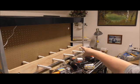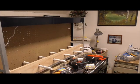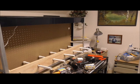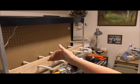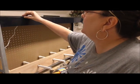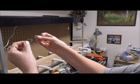And then when you get down to the other end, it's going to have to be on the inside of where the cup is, according to the way we're trying to lay it out. So it's up to you. You figure out how high you want your switches, how low you want your switches, where you want your switches, and then you're going to have to just make a hole in the back pegboard for the switch to go through. And then it's got a washer and a faceplate, which is up here. So he's going to poke the switch through from the back, and then you've got this and this that goes on the front.